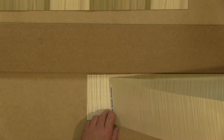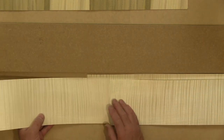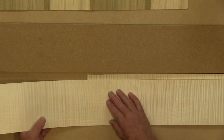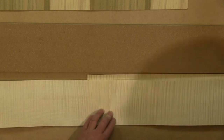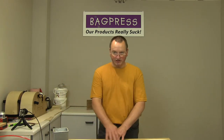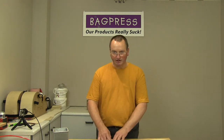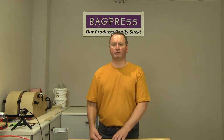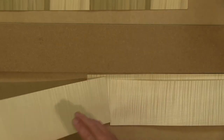So they'd have come off of the tree, you know, one, two. So if you open them out, you get the perfect line of reflection, the same as you do with solid wood. The difference being that there is no material missing from between these two surfaces. So the degree of match is significantly higher than you will often find with solid wood, where you've lost that 3 or 4 mil of material through the saw cut. Okay.